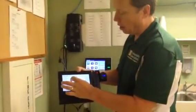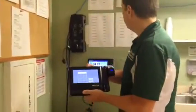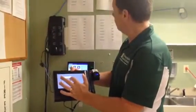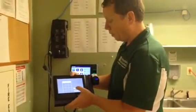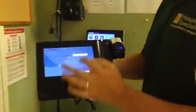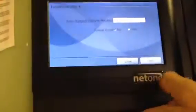To enroll a new employee, you'll swipe this card — so you'll need this card every time you have a new employee. You click on enroll fingerprint and type in their number. There's a prompt that says special enroll no or special enroll yes. If you have someone who's had to use a proximity card in the past, this is where you want to put special enroll yes. Otherwise, leave it at the default.